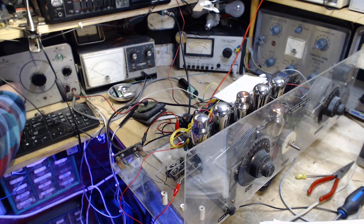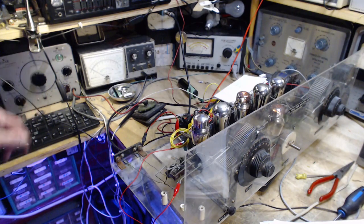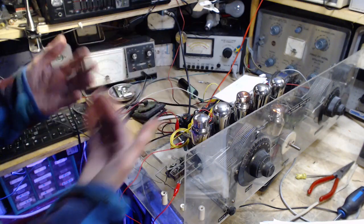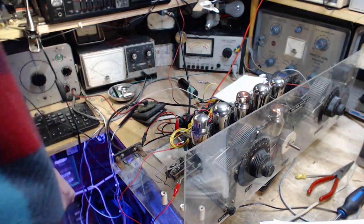Well, wasn't that a whole pile of nonsense? Looks like something was going on with this. So I got a microphonic tube in here, probably, and it is probably vibrating with the machine's vibrations, and that's probably the feedback. Just kind of a mechanical thing right inside here. Nothing to do with the radio.